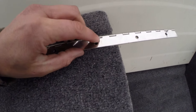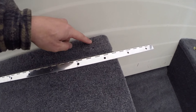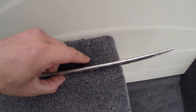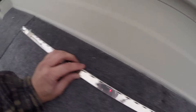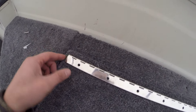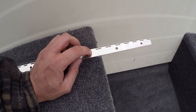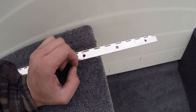I've got the hinge laid out here. I'm just going to determine where to cut — my best spot to cut is going to be right here. You've got to also make sure when you have these screws in here, if you line up the screw hole like so, you've got the screw back here, and when you go to put this one in it might hit it and run into a lot of trouble. But that's basically what I want. My cut is going to be right here — ideally I'd like to cut in between the two, but I'll cut just right on this one here.